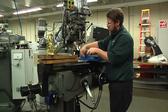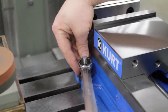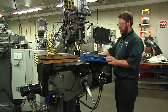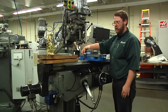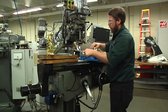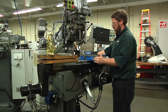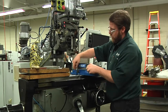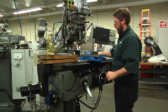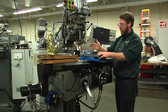Take a 7/8 wrench and tighten one nut just a little bit — don't be too tight because we still need to be able to move the vise. With this side snug and this side loose, when I go to square up the vise, this will act as a pivot point. If you had both sides loose and tried to indicate the vise in, it's going to be moving everywhere. So tighten up one side — not too tight, you want a predictable pivot point. If this side is tighter, it will pivot around this bolt and the other side will slide back and forth.